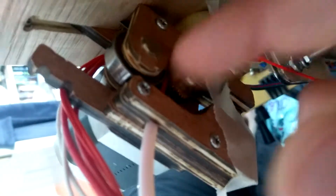I just need to re-cut that because it was too short - those were too close together and need to be expanded out a bit. There's a spring there, and then a pivot there, which tensions that bearing against the 1.75mm filament. That pushes against a pulley which is attached to the stepper motor. It then pushes the filament through this 2mm inside diameter Teflon tube, which goes all the way around and into the hotend, where it's then melted.